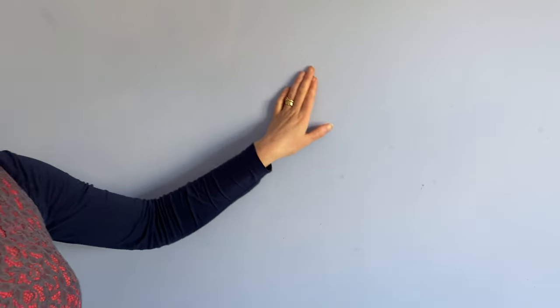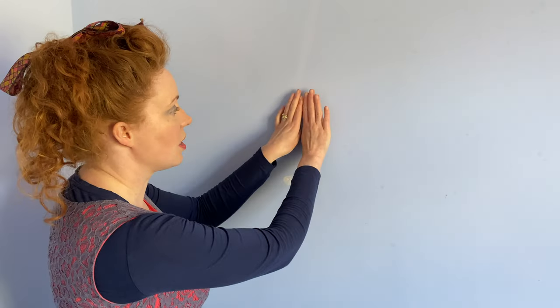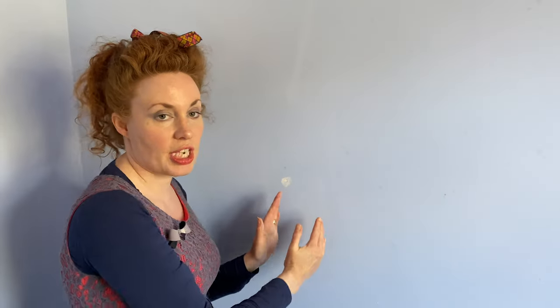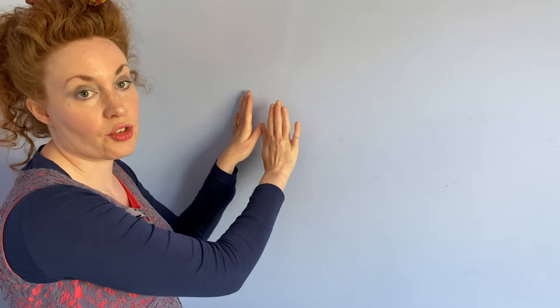Another very good reason for using lining paper, even on a quite smooth wall, is that when you put your final wallpaper up, as it dries it shrinks slightly. You might actually get a small gap where the join is. But if you have lining paper underneath, it holds it all together and that's not going to happen — so you are going to get a better finish. If you've spent quite a bit of money on your wallpaper, it really is worth doing.